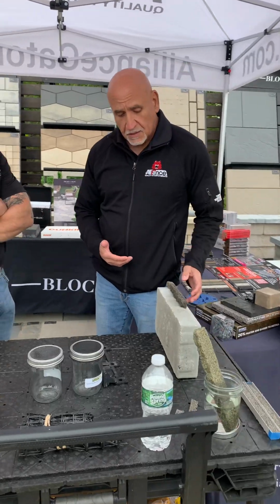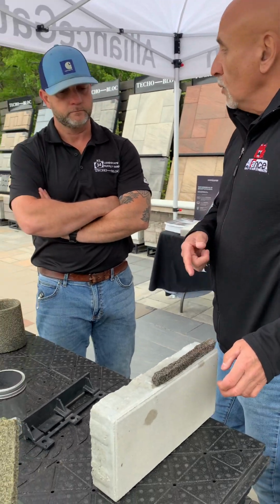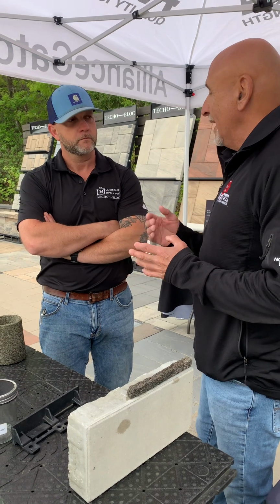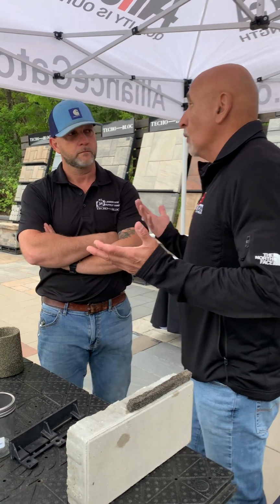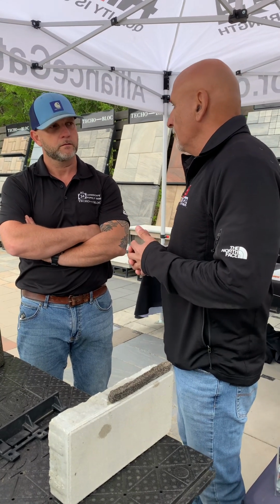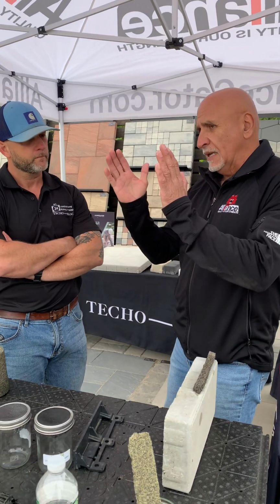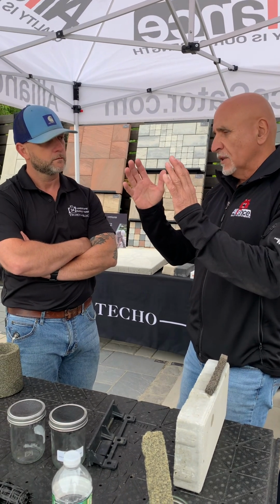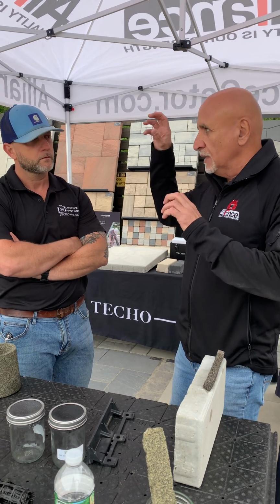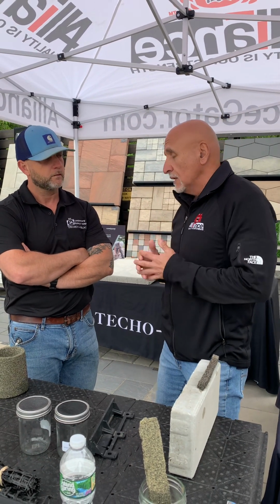A successful installation is, number one, compacting the sand in the joint. Our polysand, loosely swept into a space, has 30% void space. So it's like a loose density, and you don't want that. Because if you're looking at the space with the sand loosely filled, you have polymer beads that are kind of far apart, and it's 30% void space for water and things like that.